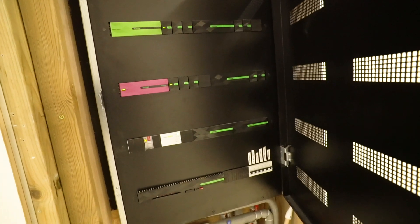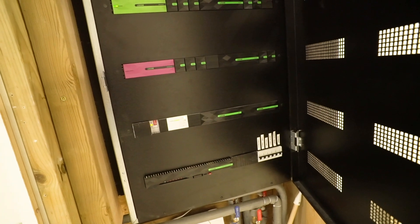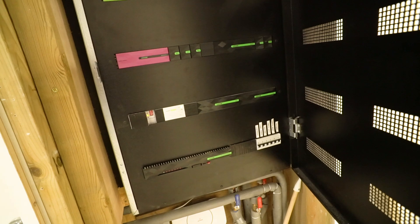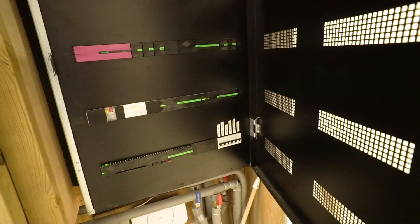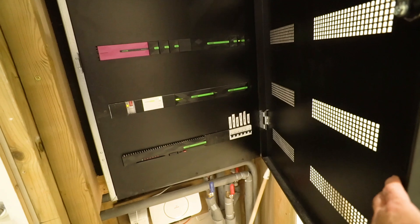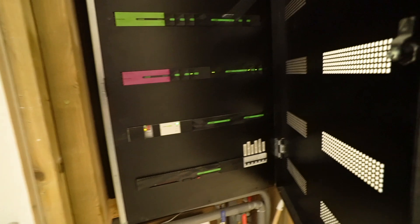A couple of boxes in here are relays — nine relays I think — that run the underfloor heating manifold controls. We're on an air source heat pump, so there's the thought that we might later just run the system open, take all those valves off, and run it purely on weather compensation. But we'll see how we go through this winter, monitor it, and that's something we can choose to do or not as we move forward.